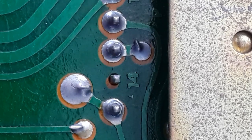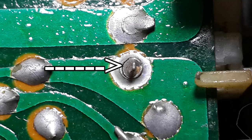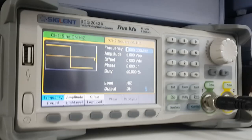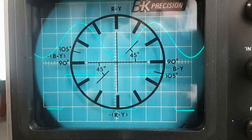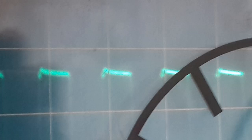Probably this trip on the airplane didn't help too much either, but the damage was already done. This is the typical open-circuit, open-solder joint, and as you can see, the one on top is on its way to breaking too. So when you fix one, you have to retouch a lot of them to prevent the next problem. Now let's take a look — at 1 MHz, not too bad, looks good so far. But believe it or not, it's not so good, and I'll show you why. The wave is thinner on one side and thicker on the other, and the square wave is not totally flat on top. So I have to readjust the filters and set up the oscilloscope as it should be.